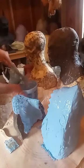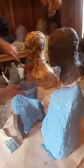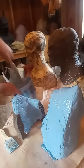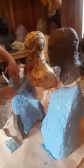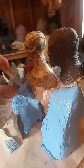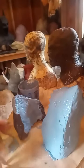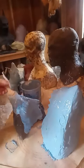Okay, it's just a little pocket on the bottom where the silicone is kind of not mixed. It's just a little bitty pocket, not much, but I did get some in there and I have to stir it in and mix it in with the other one so it'll mix with that catalyst and cure. Otherwise, you get a pocket of uncured silicone, which creates a bubble. And then when you go to demold it, it pops and leaves an air pocket and bubble in your mold. And that's not good.